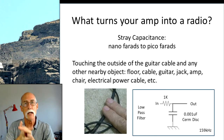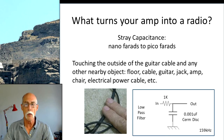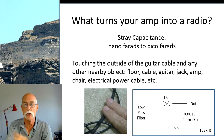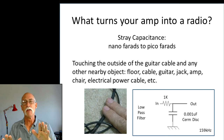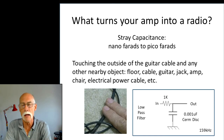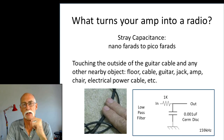On the bottom left of your screen is my guitar cable and a signal cable to an FX pedal. When you touch the two together with your fingers, the amp buzzes. In this example that I'll show in the demo, you actually pick up a radio station — but you're not hearing the radio station. People would immediately think that's not the problem because there's no AM radio station near their apartment. That isn't the problem — the problem is stray capacitance, because I've touched two cables together, or there's a jumble of cables on stage. That mess of cables introduces stray capacitance, and an RF filter will keep that stray capacitance from ending up in the guitar amp as a buzz.